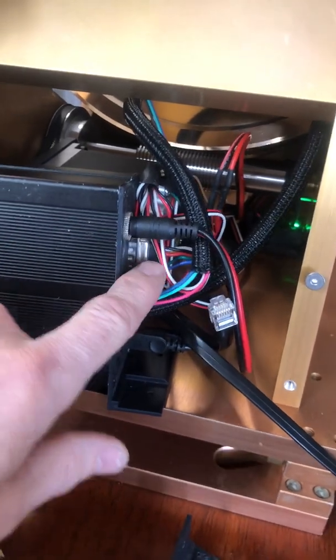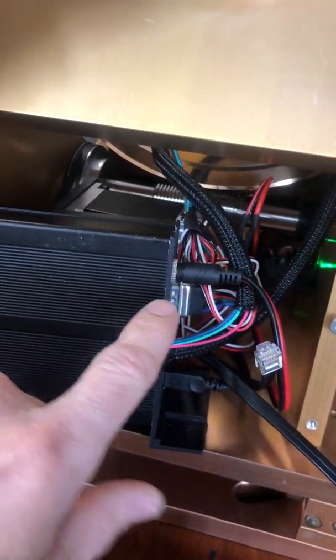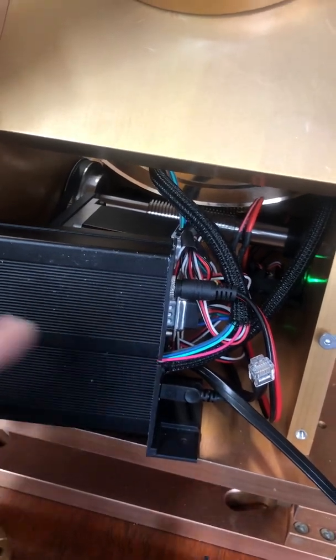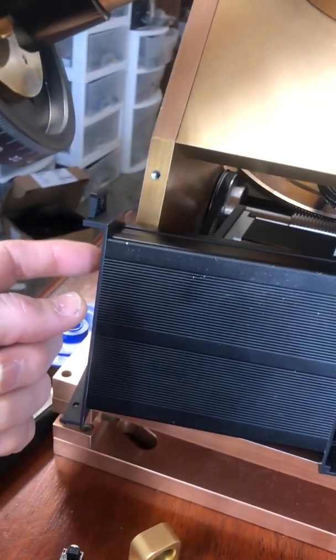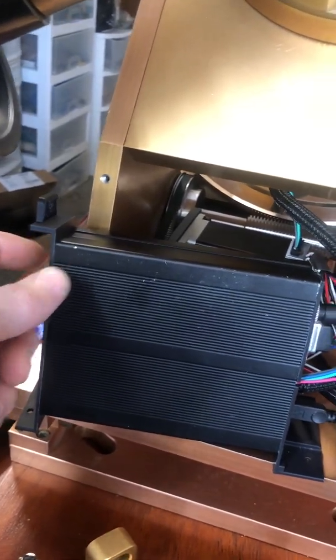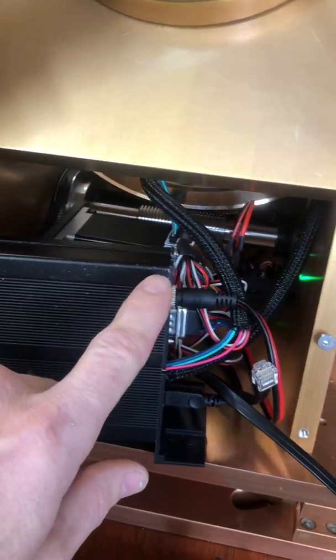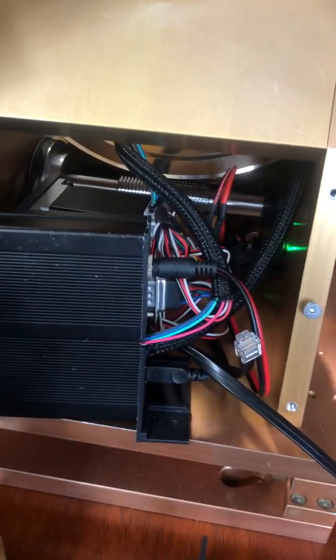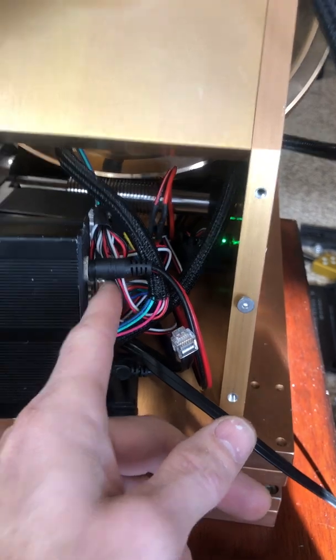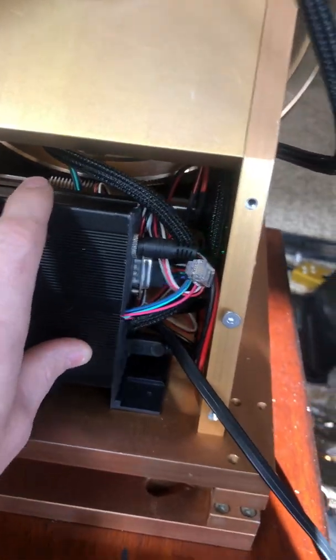One thing I would change on this design that I didn't really like: the front has the homing and the PEC correction and whatnot, but the limit switch is actually off of the little headphone connector that was supposed to be in the back. So I cut one of the traces on one of the encoders and ran a jumper there, so everything comes out of here. My limit switch would have come out the other side, but that's kind of nice now, so it's all at the front. Again, this is just because I'm using this hand controller for now, but that'll fit in there.